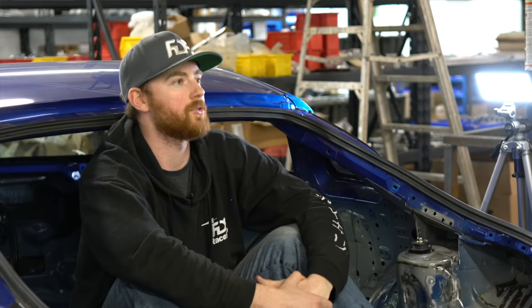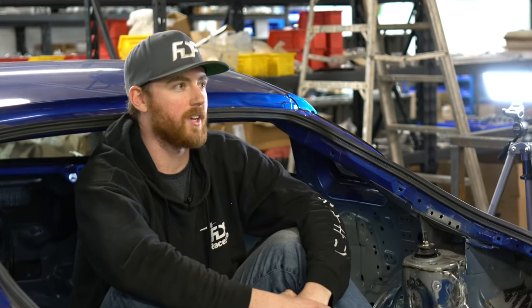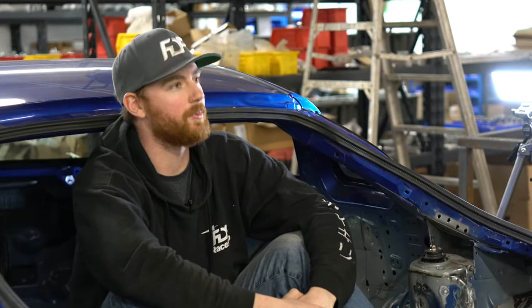We're going to go over racing regulations in terms of Champcar, FIA, drift, and all different kinds of specifications and what you need to know on how to build a cage that's going to fit your requirement. We're going to cover extras where we can tie in tubes to strut towers and make the chassis more rigid while keeping the center of gravity low, and all the other benefits that come with having a roll cage in your race car.